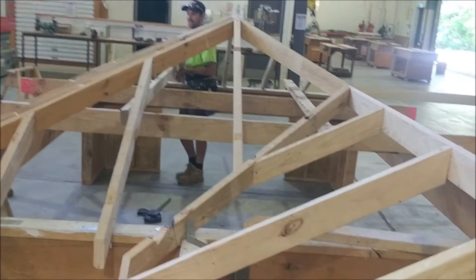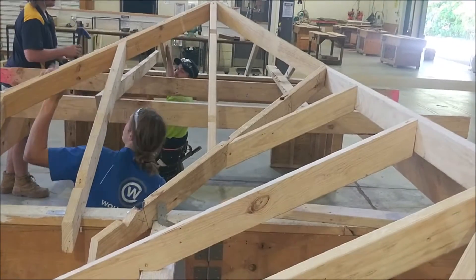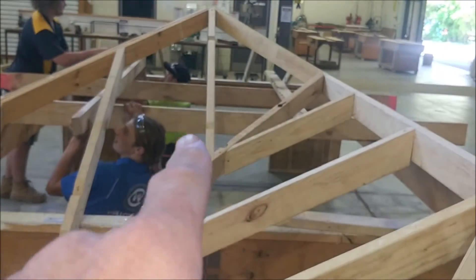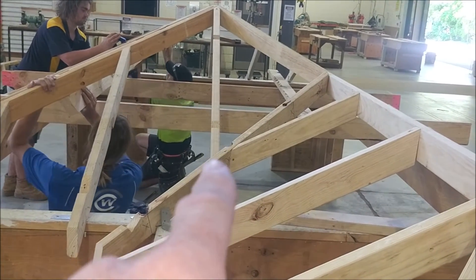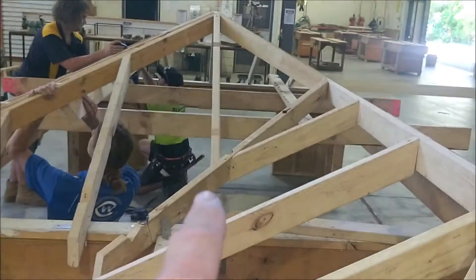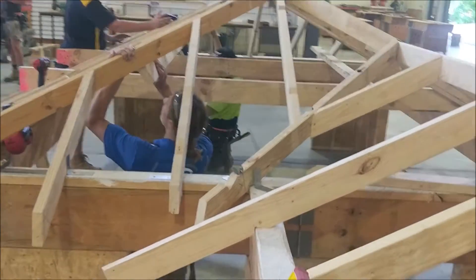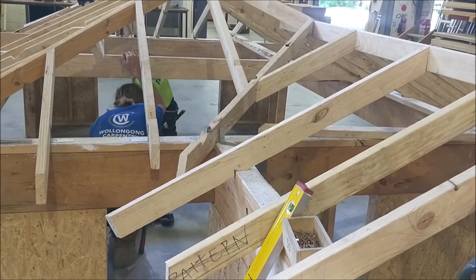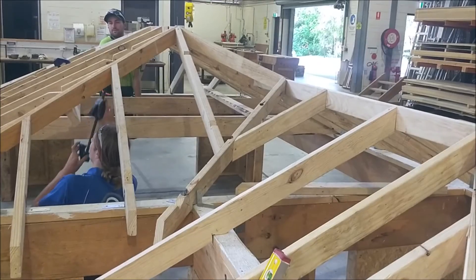You can see the crown end has become a crown end valley due to the structure of the span. They've worked out what the half span is, made a mark, and then positioned the valley crown end. You can see it's ready for valley boards, maybe for putting in another couple more creepers. They've done a fairly good job — good effort.